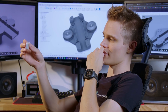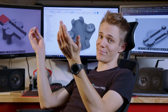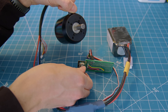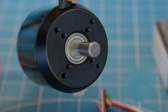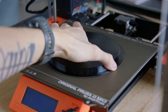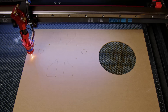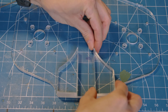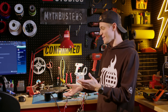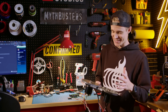As you can imagine, I was starting to feel discouraged, but that was until I remembered the first rule of engineering: bigger is better. Which meant the drone motors were out, and a pair of 2800-watt brushless motors were in. Despite being rated for 36 volts, I decided to tempt fate and overvolt them to 48 for a little extra kick. To actually fling the condiments, I printed out a pair of 6-inch diameter discs that I then lined in rubber for better grip. I then laser cut each piece of the frame out of acrylic, glued them all together, and mounted the motors into place. After all of the assembly, we have finally hit one of my favorite parts — testing whether or not this condiment cannon launcher mechanism actually works.